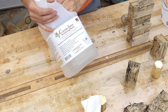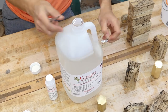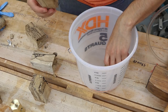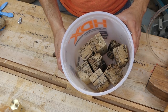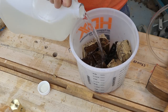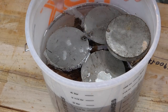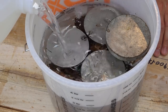Now to get the resin ready — this comes with an activator because it's heat sensitive and won't cure as a single part until you mix in the activator. That way you can store it at whatever temperature you need, but once the activator is added it has to be stored below 85 degrees. I'll arrange the blanks in the bucket, pour in the resin, and they'll start to float so I have my little weights. You can already see the resin pushing the air out of the wood. I'll top it off as the level drops.